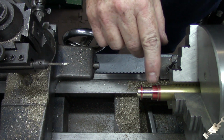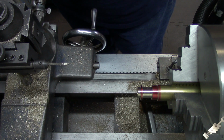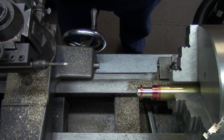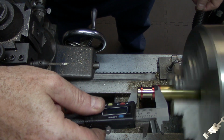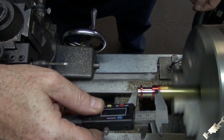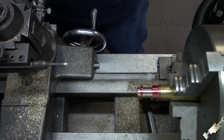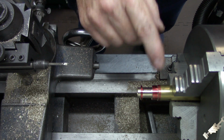Now there's going to be a hole that's the inlet port for the cylinder, and I think I mentioned before that it was 7/8 of an inch from the edge here in. So just mark that for some reference here. It's 875 right here. That hole's got to be a 16th of an inch, so I'm thinking that little relief is going to be a 32nd on either side of that line.